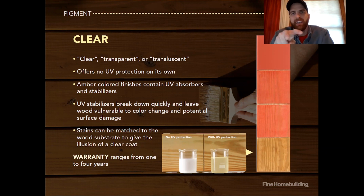And so what's happening is that deck board, which is held down with 2 fasteners into each joist, as the wood soaks up water, it's going to expand, right? Like we talked about. And between those 2 fasteners, it's going to push and compress.